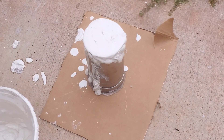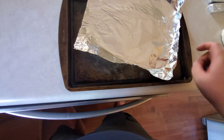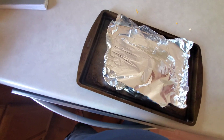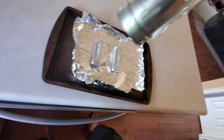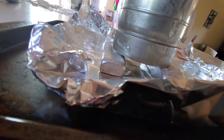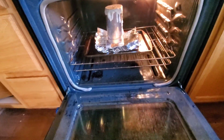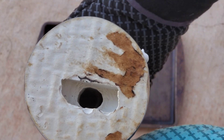We've shaken it pretty good and hopefully there won't be too many bubbles to fill in all the gaps. A cactus is a pretty standard shape, not a lot of grooves to worry about. We've let it dry, now we're gonna melt out the wax. It says to be careful with an open flame or overheating, so I don't really recommend this, but since it's an experiment we're gonna try it anyway. I put two bars of aluminum and we're gonna tip it upside down and put it in the oven - it would be better to use a kiln, but I don't have one.